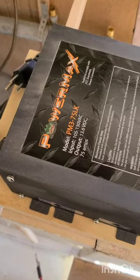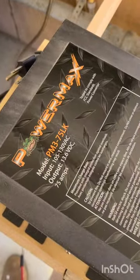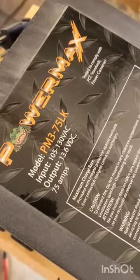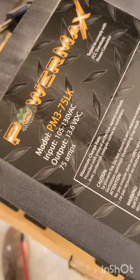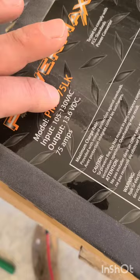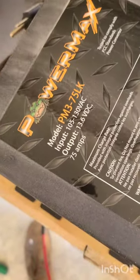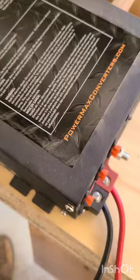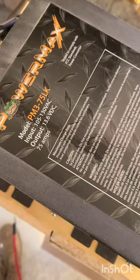This right here is an AC to DC battery charger. So if you are not off-grid and you're at a campsite, you can plug this in. It takes 120 volts — the input is 105 to 130, so we can say 110, 120 — and it converts that to 13.6 volts output, which is what a battery runs off of. So this lets you take that high voltage and decrease it to 12 volt battery voltage. This thing will charge your battery when you're plugged in at home or at a campsite, and it also regulates how much it charges so it can shut off and turn on when it needs to.